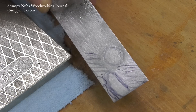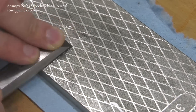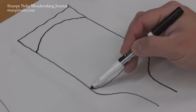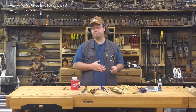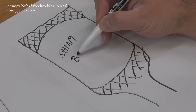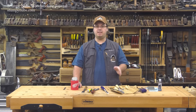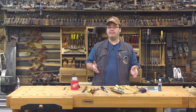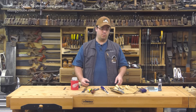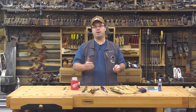To get it flat, you're going to have to wear away all those shiny areas until the dull areas come in contact with the stone too and they become shiny. This can be a bit of a crapshoot with many tools. One chisel in a set may require just a little work — it might be mostly flat right out of the package — while another tool in that exact same set may require a ton of work. The most difficult are those with a fully bellied back. These cases are more common these days, sadly, because manufacturers are grinding their bevels before the heat-treating process, when the steel is softer and easier for them to work. When they finally heat-treat it and it inevitably warps, you've got a 50% chance that belly ends up on the back where you have to deal with it.